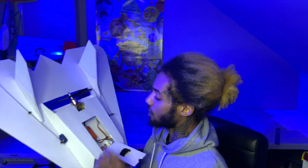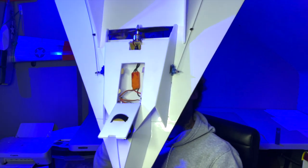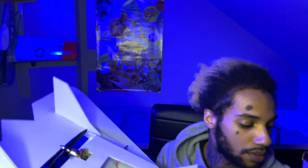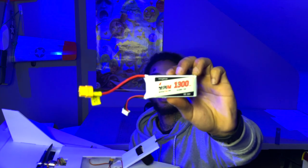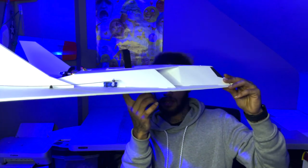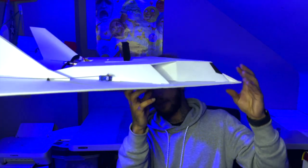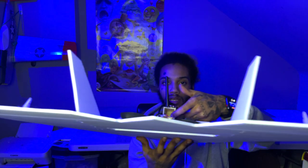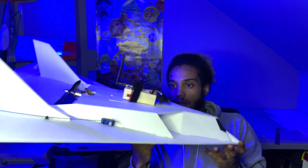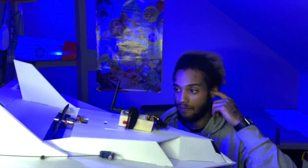The CG mark is right in the middle, and that's exactly where I have my ESC. Without a battery in the front it won't balance, but if I put this 1300 straight in the nose — right there. It's pretty decent to start with. After I add the camera and a battery — two-cell or three-cell goes right in there — we mount the camera on top and we have a little more nose weight to play with. I can relocate this wherever I want, but pre-rigged like this it should fly perfectly fine.